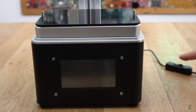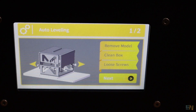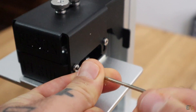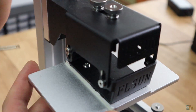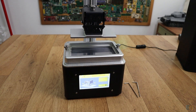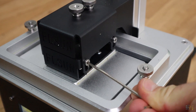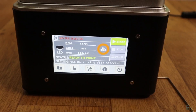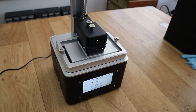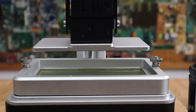Plug the power cable and power the printer on, then remove the black acrylic plate that's over the bed and put back the screws. On the screen you will have the first calibrating instructions. Make sure the aluminum printing plate is straight and fixed in place with the two screws. Loosen the four screws on the side of the plate and make sure it can move freely up and down. Now select Next on the touch screen. The z-axis will home itself and get lower till it reaches the optic switch. Tighten back the screws, press Done on the screen, and then lift the print bed and pour some resin to about one third full. Home the axis once again and we are ready to print.